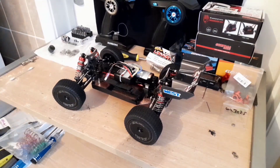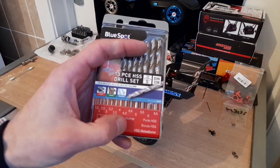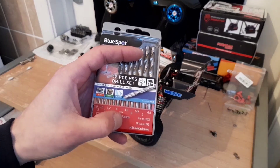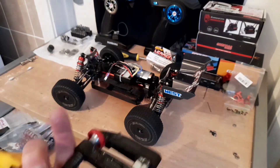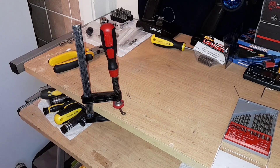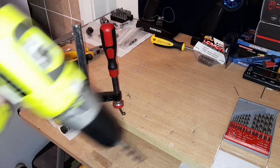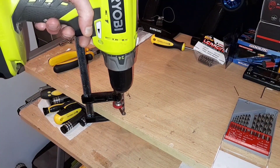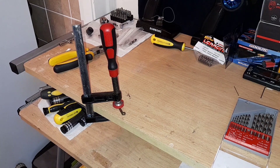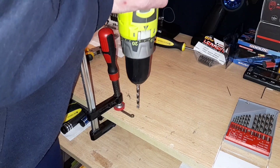I don't know where I picked these up, but they're actually Blue Spot and they come with some funky sizes — 4.5mm, 4.8mm, 5mm — which is excellent. You're going to need a clamp and some pliers to press fit your bearings in. I've already took this off, just undone the two screws and slid the bar out. I've got a clamp to the desk. I've got the 4.5mm drill bit in and I'm going to work my way up in succession to the 4.8, the 5, the 5.5 and the 6. I'm going to hover the drill so it gives very, very fine chippings — I don't want it to dig in because it'll just snap the end off, as it's just aluminium.